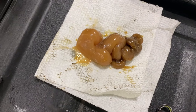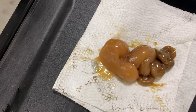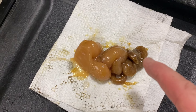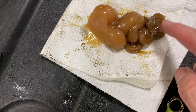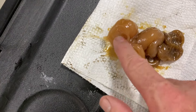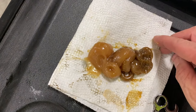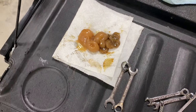Here's an example of the grease that came out. I did get rid of some of the old already, but you can see the newer grease over here versus the older grease — it is quite a bit thinner and broken down compared to the newer grease. So all four blade hubs are going to get fresh grease in them, put it back together, fly it.